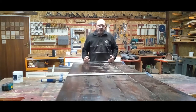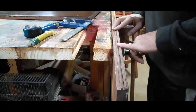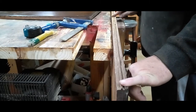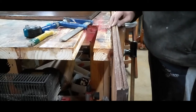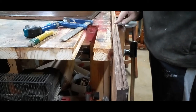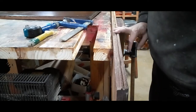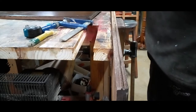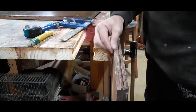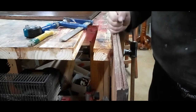We're going to cut off 600 millimeters off the end to make it a bit shorter, and then take it from there. For now I just want to clean up all these joints between the planks and see if we can get this top together with the four planks we're going to use. Preferably a glue with a very low viscosity — in other words, very runny. The acetone just gets rid of the oily stuff in the wood and gives the glue time to set and actually penetrate the wood.